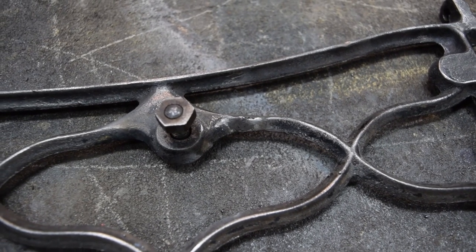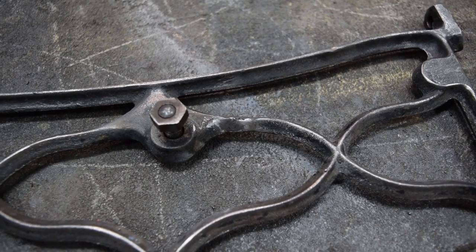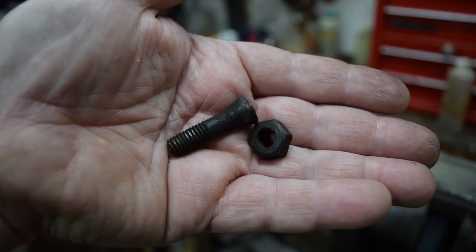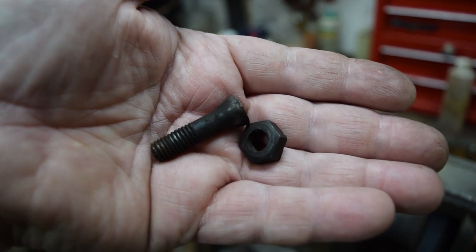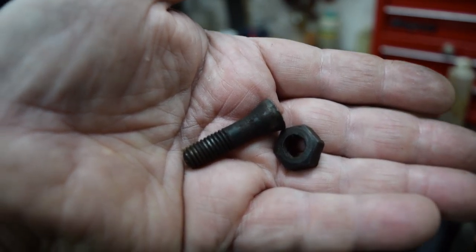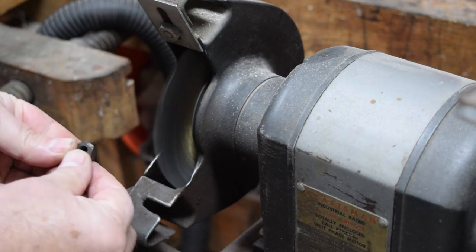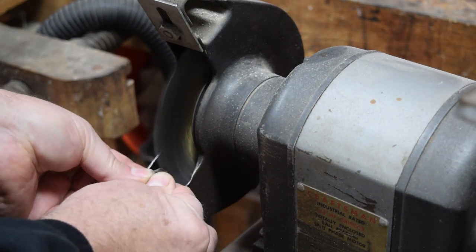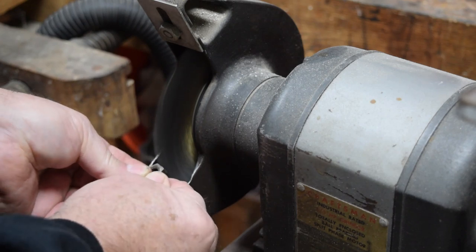And here's how that weld came out. I'm pretty happy with it. That shouldn't be any problem for us from this point forward. And here's just one of the fasteners that's involved in the base. This one, I believe, attaches the cross piece to the legs. You can see they're black. They've got a lot of dried grease on them, some rust. They're pretty filthy. So let me show you how I clean these off. This is just a wire brush on my grinder. Really just takes a second.